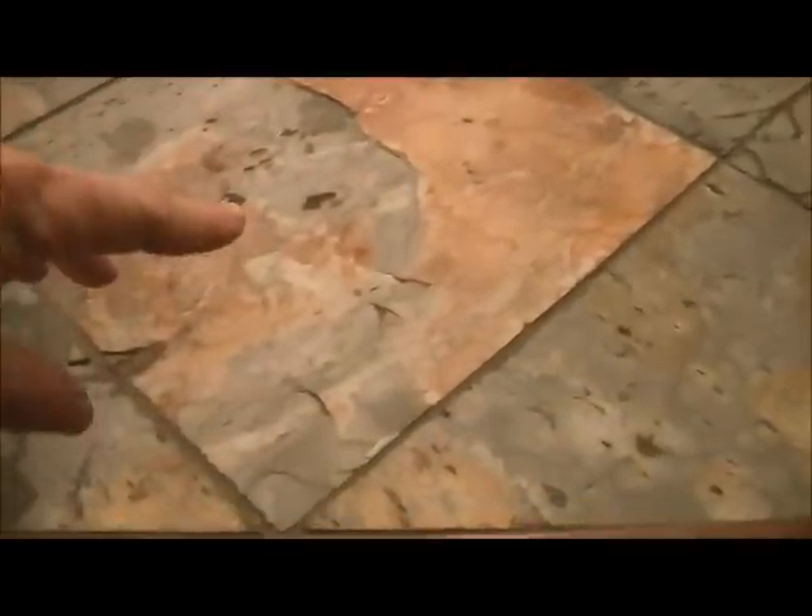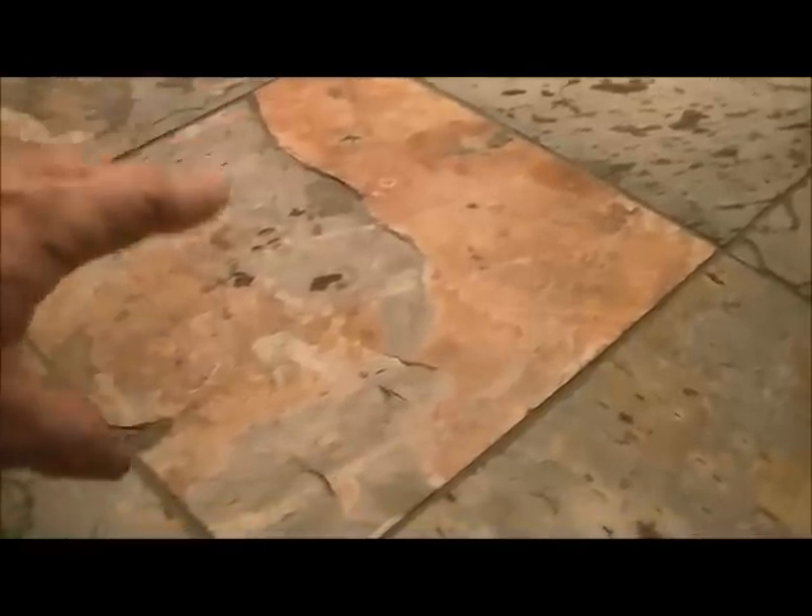It's like a croissant — it comes in layers and sometimes falls apart in your hands. It's very absorbent of water, extremely absorbent, to the point where this tile needs to be sealed at least two or three times if not more, because it's just going to absorb as much liquid as you can put down on it. That's going to protect not only the grout — which is usually the main focus — but the tile too. This entire bathroom actually got tiled in slate, which I would never recommend to anybody, but this is what the customer wanted. So we've got 16x16 on this entire floor, all the way around and into the closet area back there.